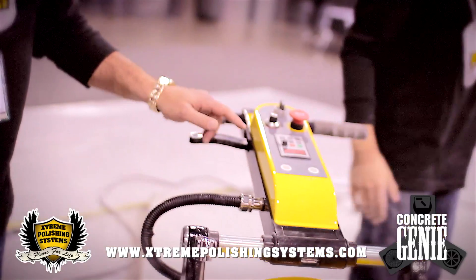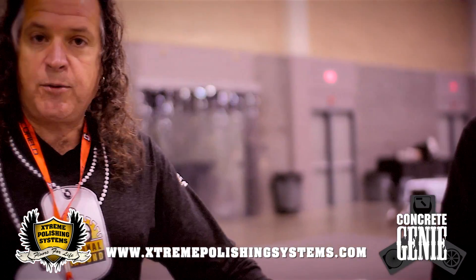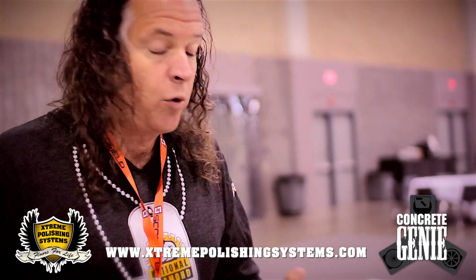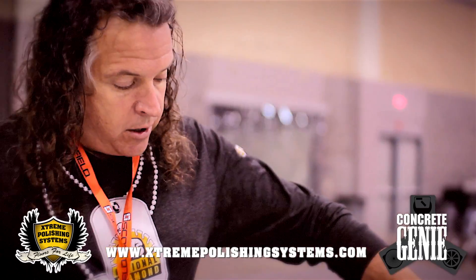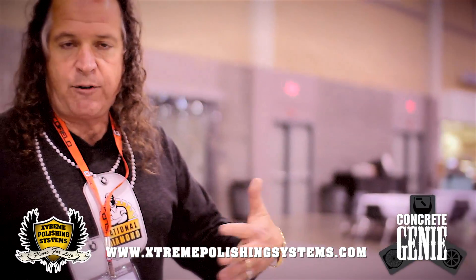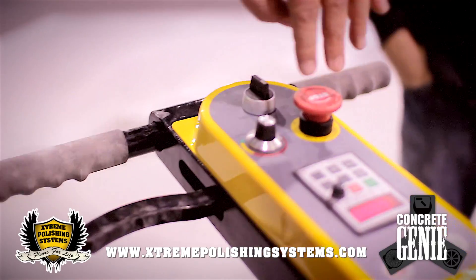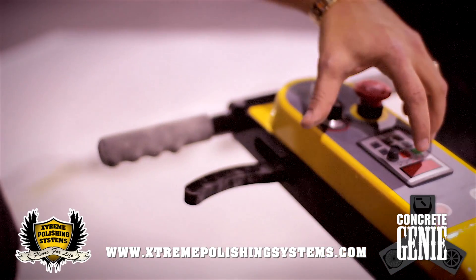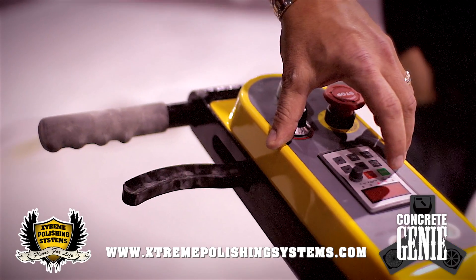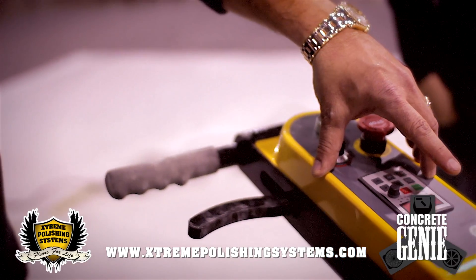This is your control panel — it tells you when the machine is running and when it's off. You can run this machine either clockwise or counter-clockwise. Normally if you're having problems with your diamonds on very hard concrete and don't have a soft enough diamond, it's going to look like the machine isn't cutting. Simply turn it counter-clockwise if you're running clockwise, or clockwise if counter-clockwise, and you'll redress the diamonds. You have your emergency stop button here in case you hit a piece of metal in the floor or something doesn't go right. This indicator will tell you if you have any type of improper electrical current and give you a fault signal — refer to your user's manual at that point.